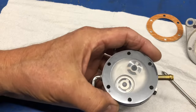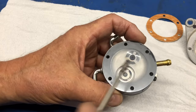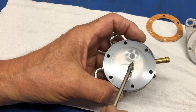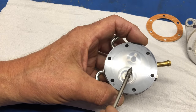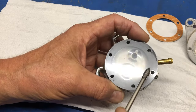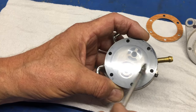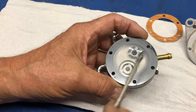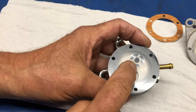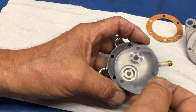Now, corresponding, here's the diaphragm that's over the valves here. And it appears absolutely fine. I'm looking at the light going over it. There you go, so you see the light going over. So it's not dished down, it still looks like it's flat, so that it can actually go down and up. Okay, so let's take that off very carefully.